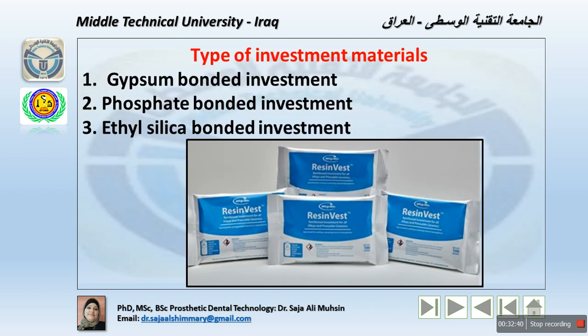The types of investment material we have: gypsum bonded investment material. They are used for casting gold alloy. They can withstand temperature up to 700 centigrade. Of course, phosphate bonded investment material is the most commonly used for metal ceramic and cobalt chromium alloy. They can withstand higher temperature, and as I mentioned, it's above 800, and up to 1300 centigrade. And we have ethyl silica bonded investment. They are an alternative to phosphate bonded investment material for high temperature casting of base metal